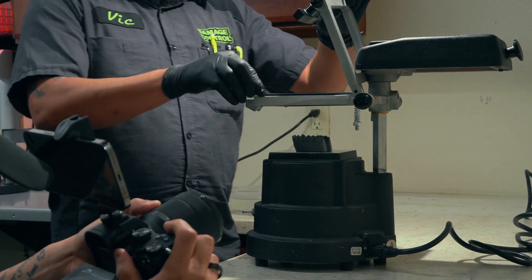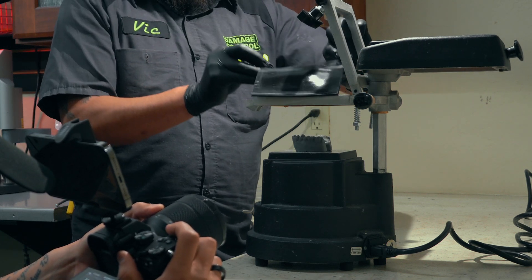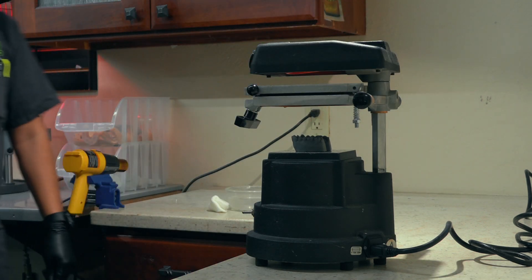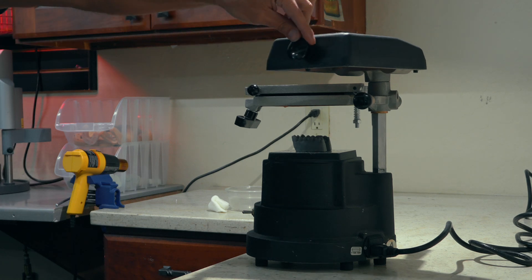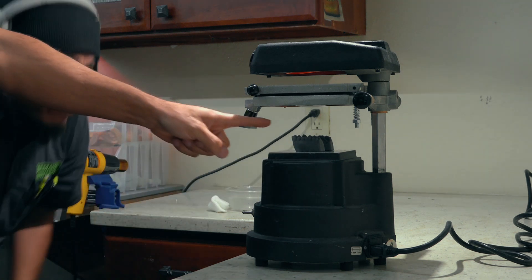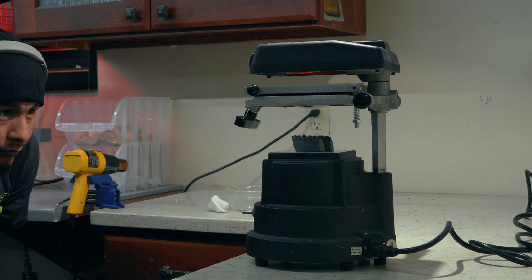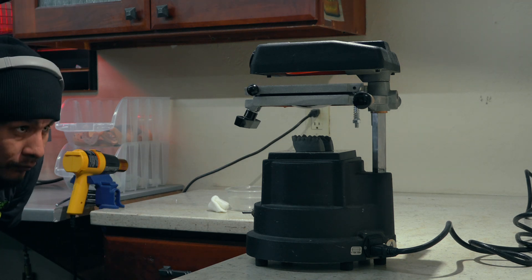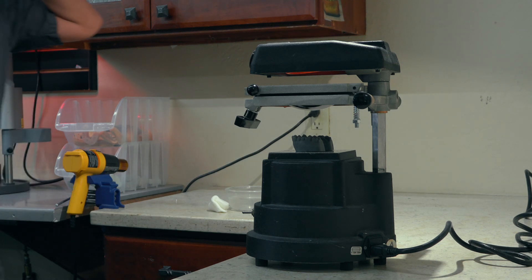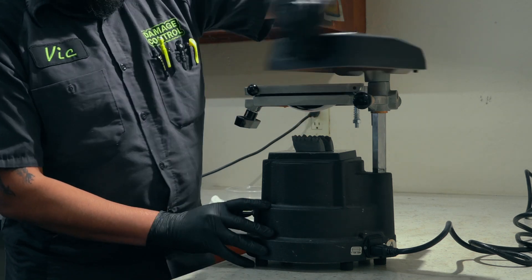Vick is now heating up one end of the four millimeter sheet and flipping it over. You don't have to do this, but it seems to work best to get the melt-down we want. When it gets red like this it should be good to go — when you get a drop-down on the bottom of the sheet of about a quarter inch, it should be ready. That's kind of another pain about these machines: everything is manual, you have to keep an eye on it. Vick says it's ready, so we're going to vacuum form it — it's a really loud machine.